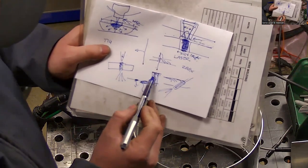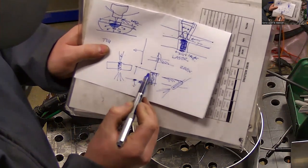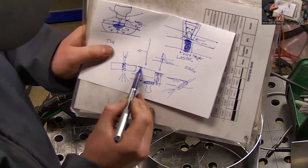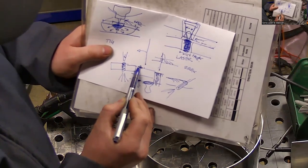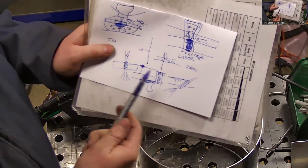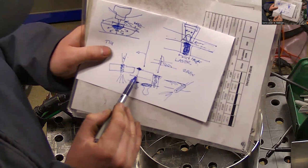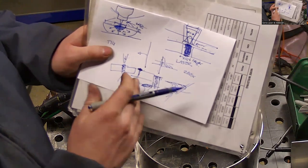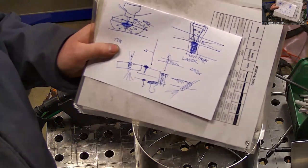And then if you're fusion welding, a lot of times, even though the joint might be fit up nicely, you're going to have a small air gap in here. So it's borrowing material from here, and you might have a little undercut after welding. So the wire is just basically going to compensate for any small gap. The wire you're integrating into the material might not be all the way through. It's just going to add material on the surface, and it might be incorporated down deeper into the weld, but it's more just to prevent undercut and to help you deal with any gaps.